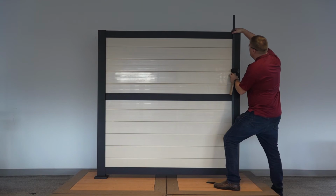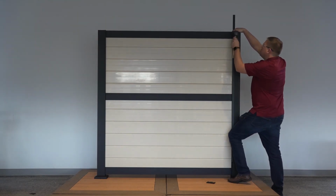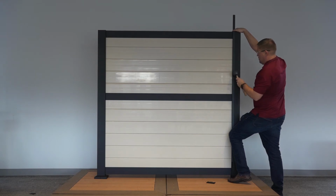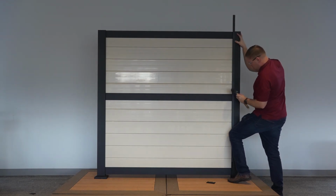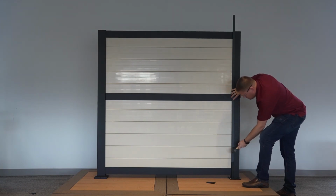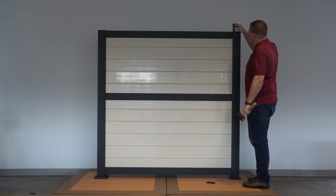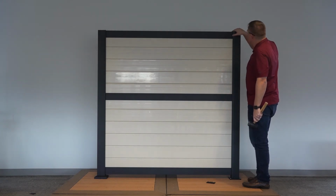Hold the screw cover strip approximately 6 inches from the top of the post and snap and slide, or use a soft rubber mallet to gently tap the aluminum screw cover strip into place. Hook one side of the cover and push down to snap the other side. Slide the cover down the post to hide the screws.